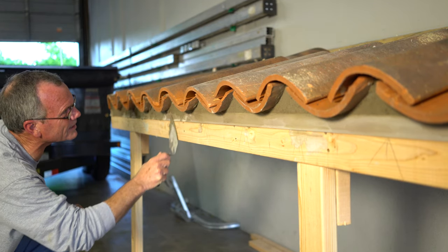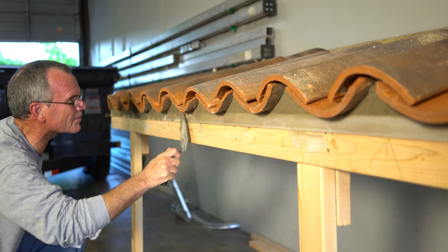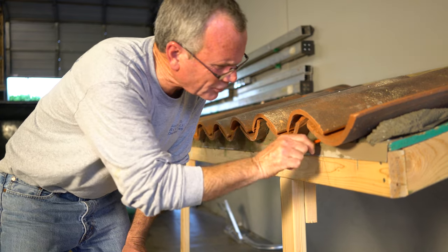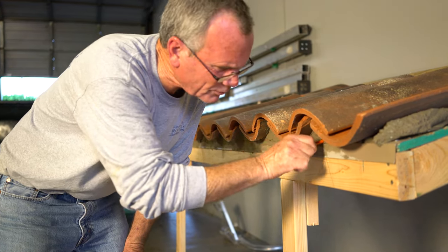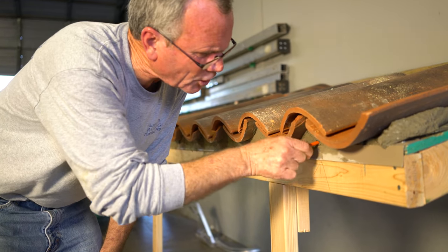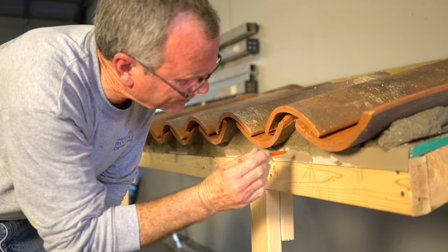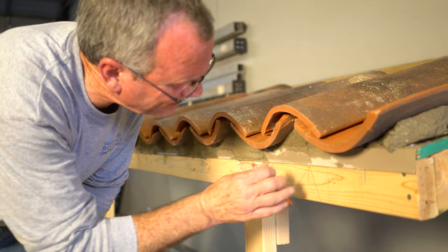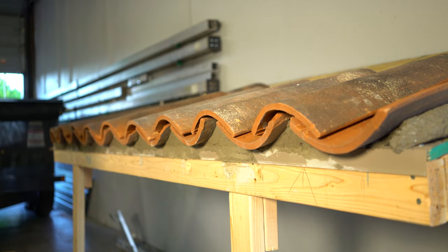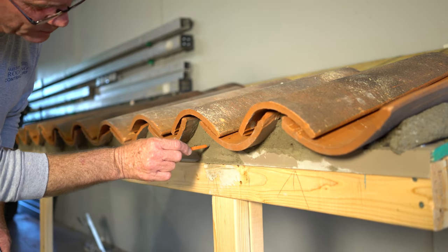Right here is where it was — I've got up here finishing. Water is going to come through the masonry anyway, but you don't want it building up behind there. Any water standing on roofs always creates leaks. So you want to get this in early enough. You want to get that hole as neat and tiny as you can, and that is a weep hole. You see these on foundations, you see them under the brick, you see them all over the place with the little weep holes.